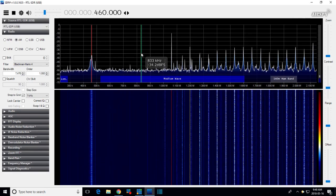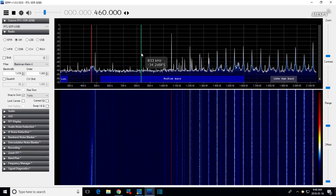You know what I gotta do at this point? I gotta twiddle the oscillator adjustment for this band and see if something happens. So I'm sticking a tool into that slug that's wandering and loose. Now I'm gonna turn this and maybe the peak will show up. Not that way. If I remember right, it was the other way, with the slug almost falling out.